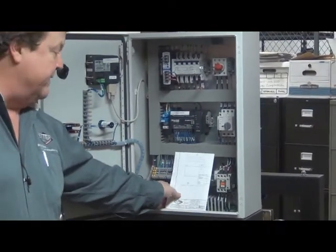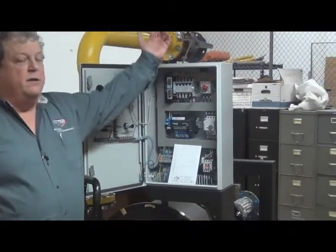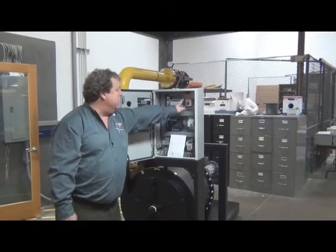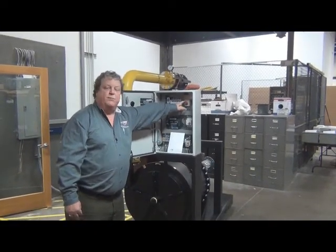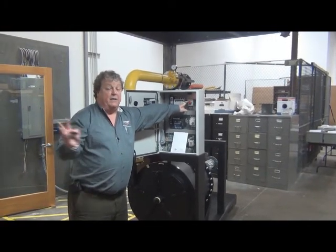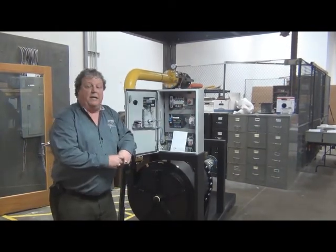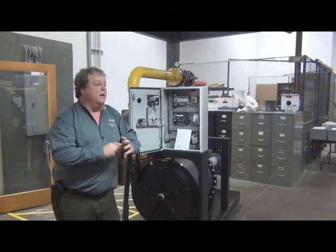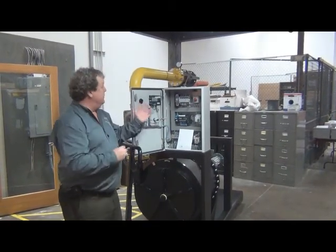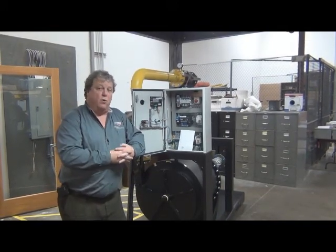This makes it very easy for the installing contractor. Basically all the electrician is going to be doing is bringing in the three-phase service — probably through the top or side of the panel — and terminating to the three connections on the rotary disconnect. Everything else is already done. Three wires, two flanges, and you're off and ready to go. This unit can literally install within minutes.